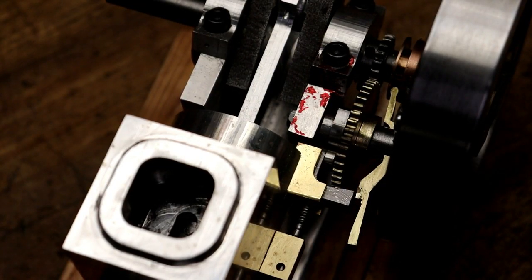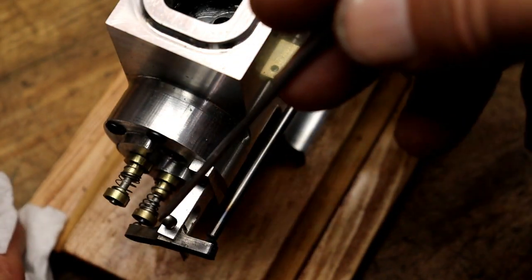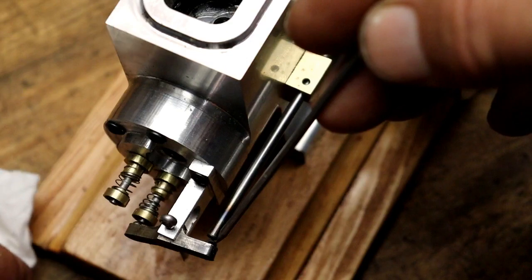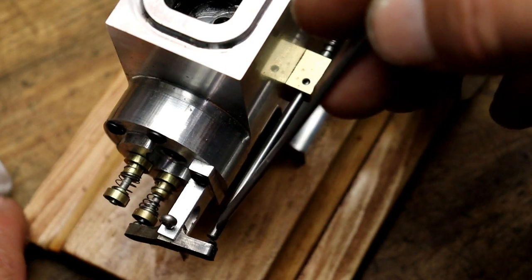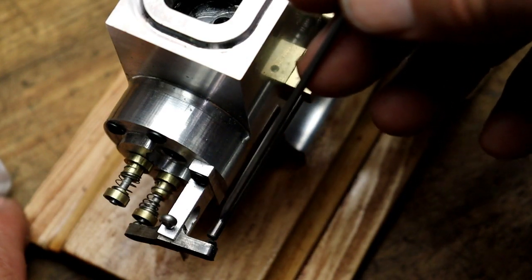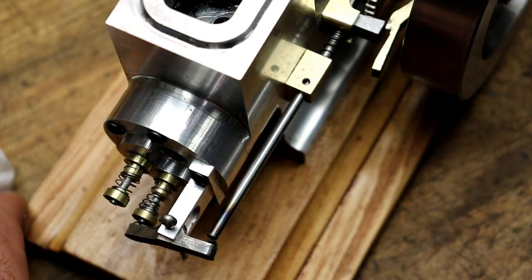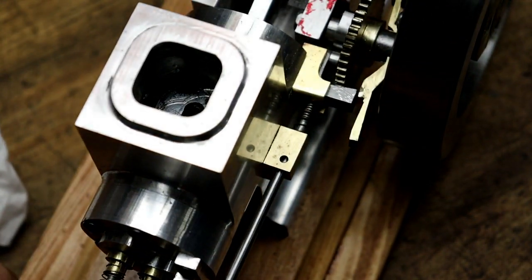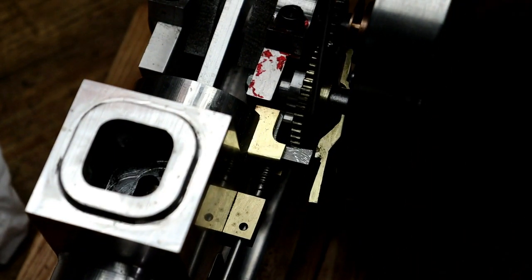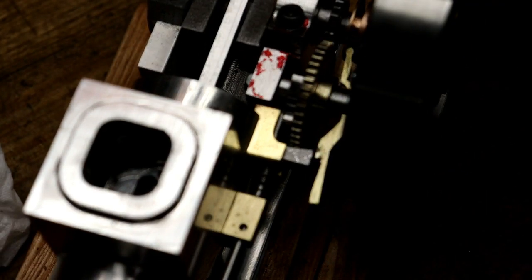I have the governor levers and stuff all figured out on both of them. I ended up putting a ball bearing in on the rocker arm - I put a ball bearing over here and flattened out this end. If I was to make it over again, I would put the ball on the push rod and have this surface flat - I would not put a ball cup in that side. But I did it that way and it'll work. In the lever back here I ended up having to modify the heck out of that.